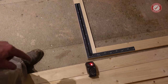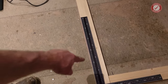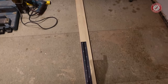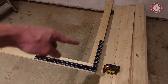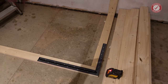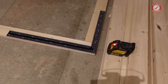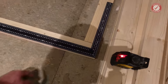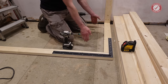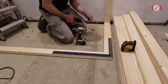So the laser is kissing the edge of the bottom plate of the stud wall on that direction, so we know that we're all in line that way. I've also done exactly the same on the bottom plate going in that direction as well. I've already squared it off at the top, so if everything's plumb then it should be square at the bottom as well — and yeah, that's pretty damn square. I'm going to try and hit the joists on this side. The joists go this way — we've got one there, one there, one over there — so nice big screws through into the joists.